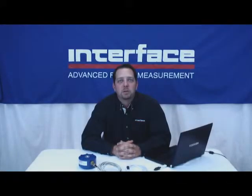The INFUSB is available in three different configurations, making it compatible with the majority of Interface load and torque sensors. There are plus or minus 5 volt, 0 to 20 milliamp, and millivolt per volt input models available. A 16-bit A to D offers over 60,000 counts of resolution. Sample rates are software selectable, all the way up to 2.5 kHz. Cable lengths can also be customized, up to 25 feet total.